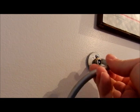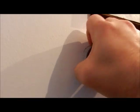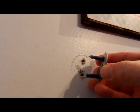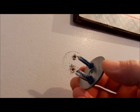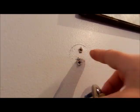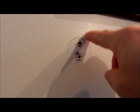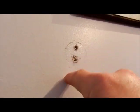I'm going to show you how to actually keep this thing on. Whoever put this in — this keeps popping out. What happened is they have these anchors in here for the drywall. What they probably didn't realize is that right next to this, about a half inch over, is a beam.